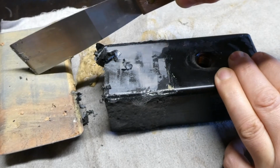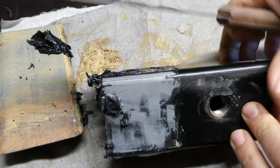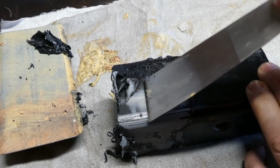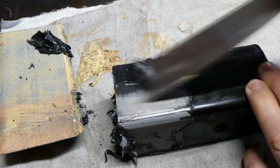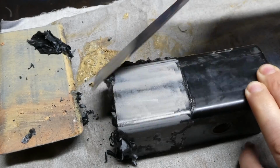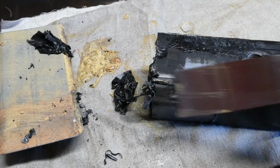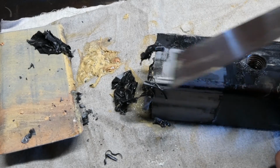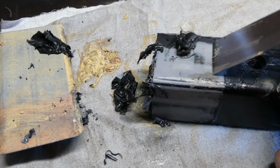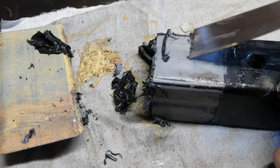This one here had a really thick, nasty coating. You'd use a grinding wheel on it and it would just clog up. Flat discs lasted a matter of minutes. Good to know this is coming off really well. Probably going to persevere and just remove the paint off all components, because I will need to give it a uniform coat of paint on the whole part at the end.